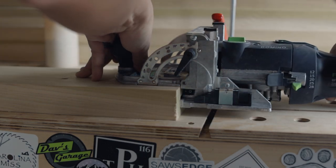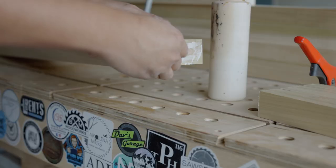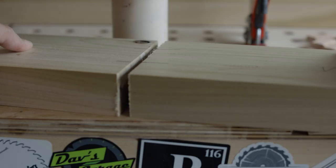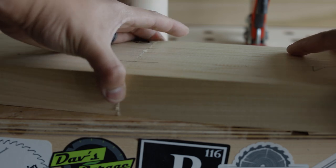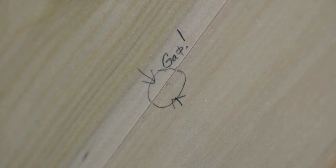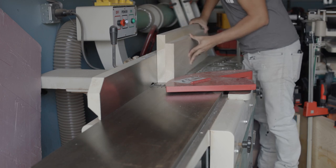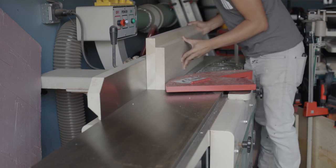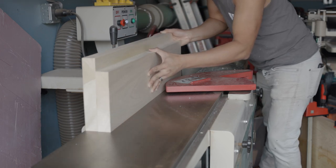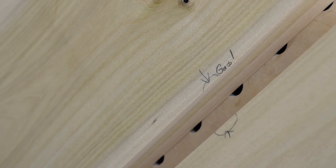With that said, let's get into the build. I got all the boards milled to the correct size for the rails and stiles. There was one rail that I accidentally cut a little bit short, so I used the domino to splice in an off-cut — once it's painted you won't notice the seams. To ensure there are no gaps between the blanks that would make up the raised panel, I jointed the edges that would be glued together. This creates a perfect and seamless panel that I didn't need to fill with bondo later on — and as you can see, the gap is gone.